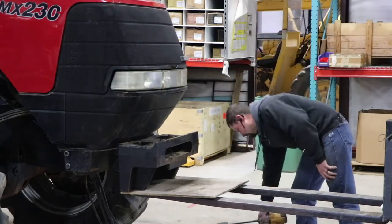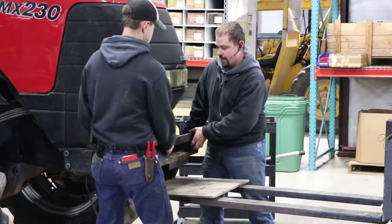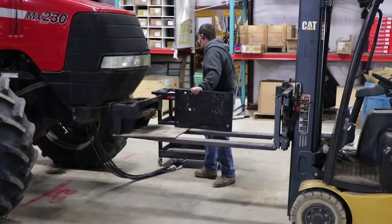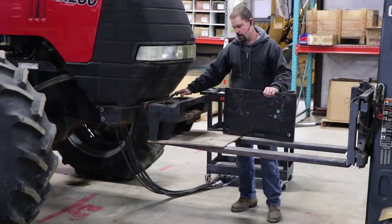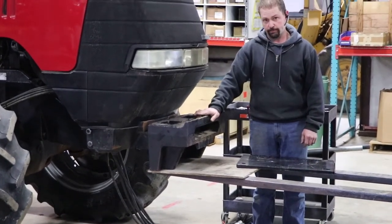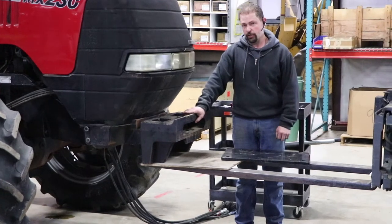At this point, we're going to slide the weight bracket back towards the forklift and leave about a one-inch gap there. This is Part E for Edward on your three-point kit. This part will simply be slid between the weight bracket itself and the frame of the tractor. We will use Loctite on these bolts, as we advise you guys to do as well — that's your choice. This particular model has pretty long bolts in it, so for the video we will not be replacing those. However, we do recommend changing those out and putting longer bolts back in there.